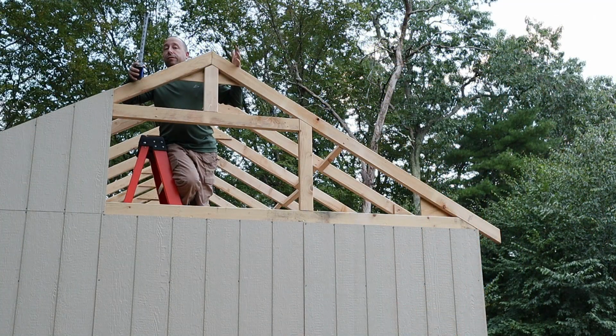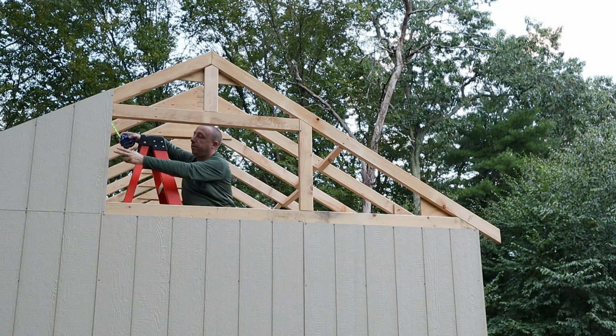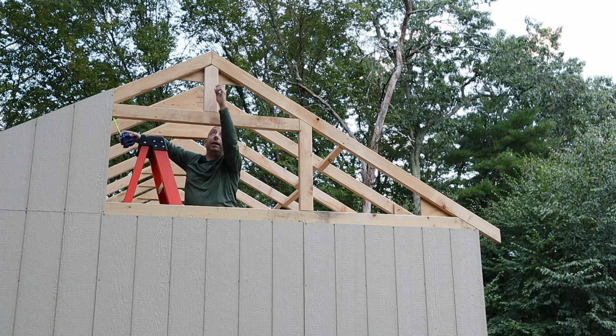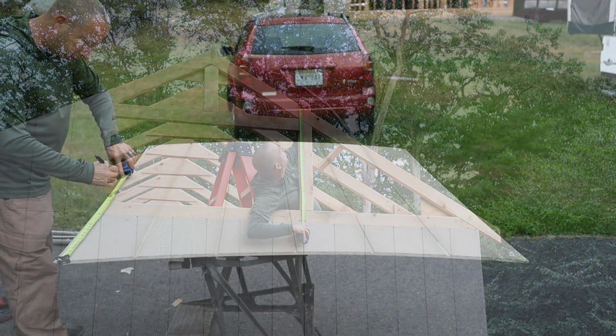So now I'm going to measure out the centerpiece on this side. Now of course this is going to have 2 angles cut in it, so we're going to start over here, and I've already measured this one, and this of course is 32 inches, which is what it was on the other board. Now I'll measure the center, and then we'll double check this side, but this one really should be 32 inches too, if everything is square. 45 1/4. And just like on the other side, we're getting 32 inches over here.